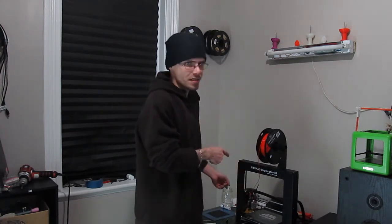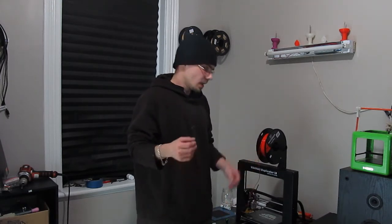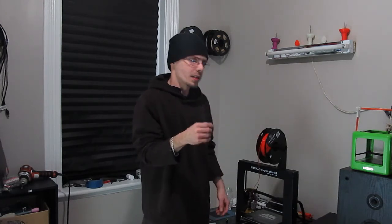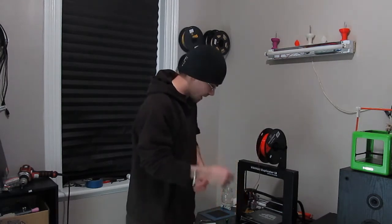As a review, I have to point out some flaws. My biggest problem with this printer is the MK10 hotend. I kind of would have rather had a J-head, and I'm thinking of putting the J-head I have on this instead. The fan's not really pointed right where it needs to be out of the box — a lot of people just turn the fan a little bit. I just printed a circular fan shroud. They're available on Thingiverse. I'll put some links to mods in the description.